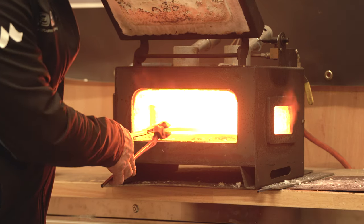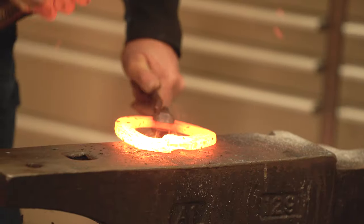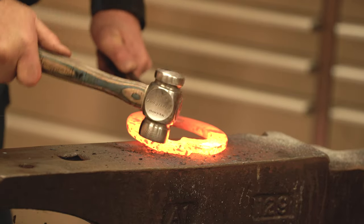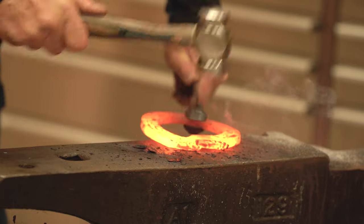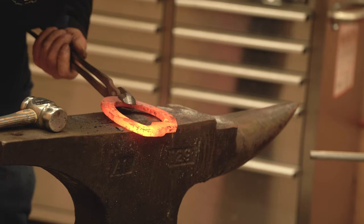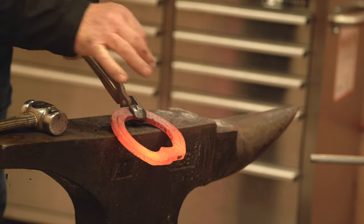What I'm looking for is an equal heat right the way through — the top, middle, and bottom of the weld all the same color. Ready to start welding. First hit isn't too hard — let's get it stuck. Now I corner my hammer into my scarf to get the scarf welding. Turn it over, give it a second, then reheat. I'm kicking away at it — I'm not worried about the thickness right now. I've got my scarf in, and in one heat the scarves have disappeared. Now I can come back out, start flattening and giving it shape.